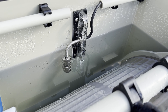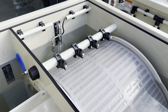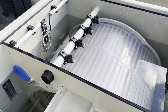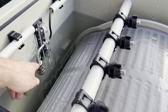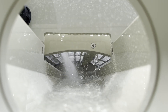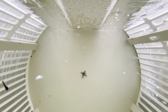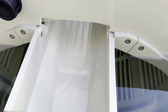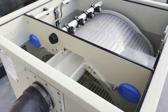The sensor is currently on holder number two — this is for a gravity-fed installation. When the water level drops, the control box starts the cleaning process: the drum rotates and the nozzles spray water to clean the filter panel. The drain gutter collects debris dislodged from the filter panel.